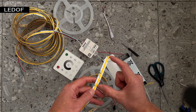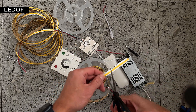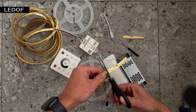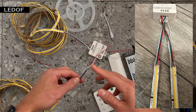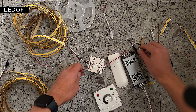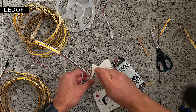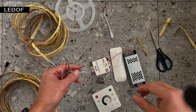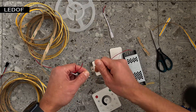The LED strip can be cut every 8.5 cm or 3.5 inches at the marked locations. If you need to connect two or more LED strips in parallel, the arrows on the LED strip should point away from the controller. Carefully unscrew the connectors on the controller. Connect two wires together: white to white, green to green, red to red.